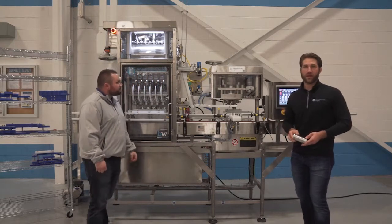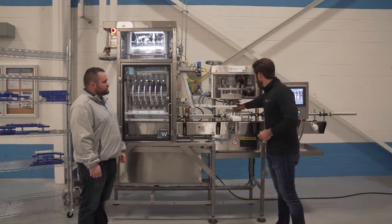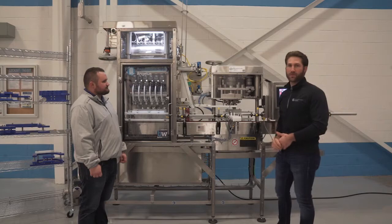With the seamer we supply 12 and 16 ounce plug gauges that can be utilized to set your pin height. With the plug gauge in, we will actuate the lower lifter up, the hand wheel will go up and then back down until that pin height threshold is met.